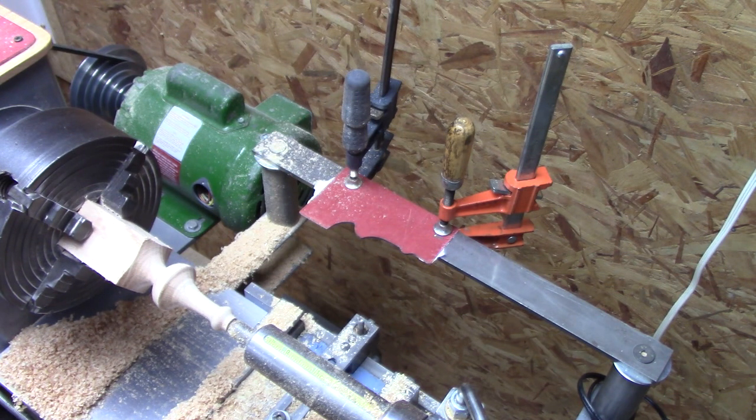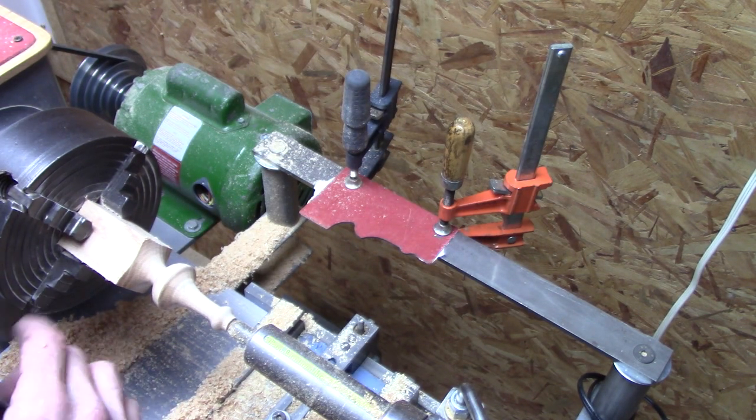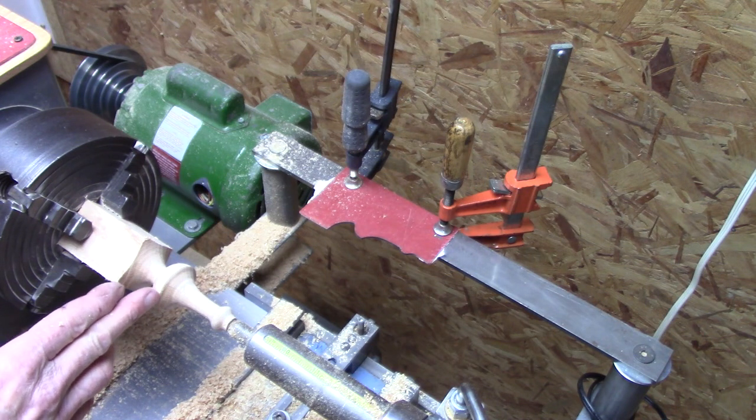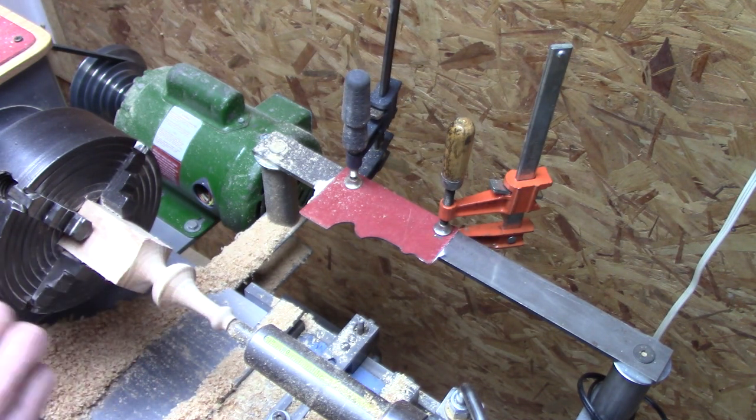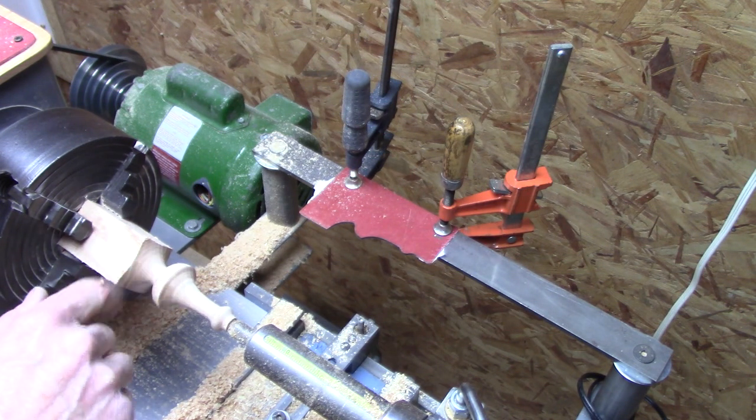As you can see, I've used a combination of power feed and hand feed. And on the gullies, I go from the high point down, and then the high point down this way. The driven capstan helps, but it still has troubles climbing out of that.